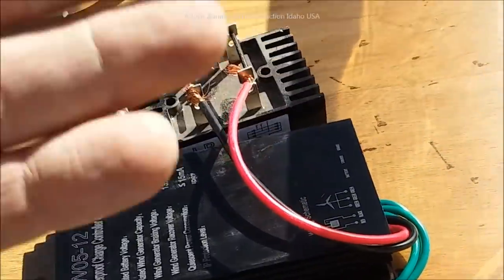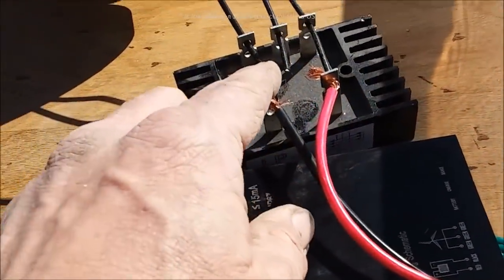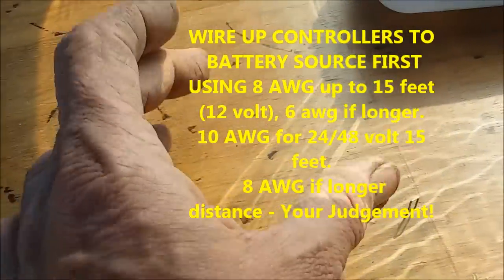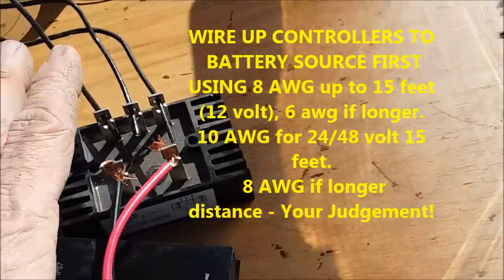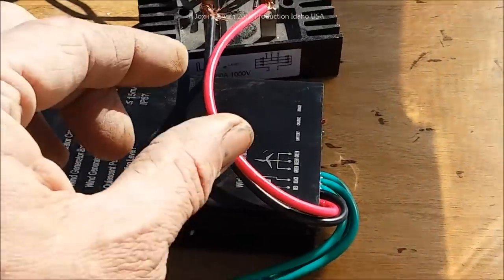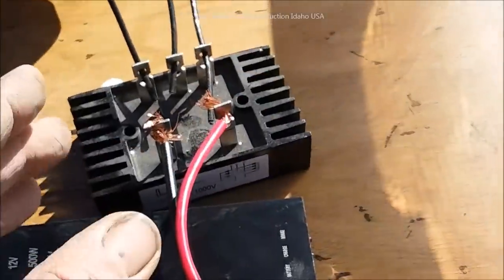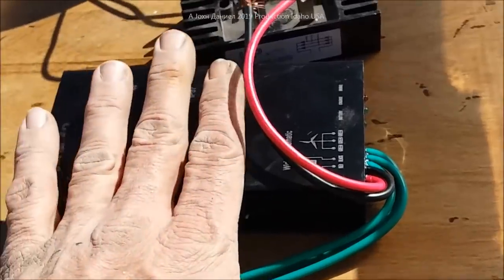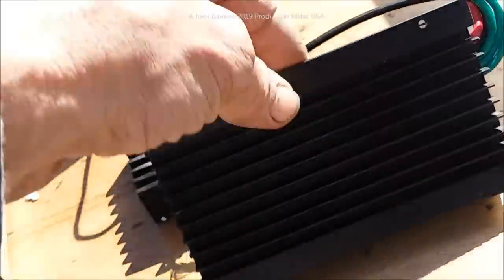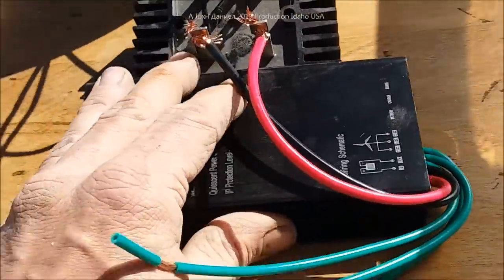Here's the deal: what it senses for its braking system is the voltage from the battery, not the voltage from the turbine. Then run 8 AWG wire from the rectifier to your battery bank through an ANL100 fuse. Now you have a diversion braking load system. The included rectifier has little diodes inside — your battery voltage light will work, your brake light will work, but your charge light won't come on. That doesn't matter — you've bypassed it but kept the internal braking ability.